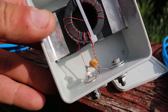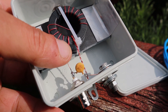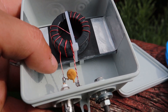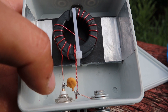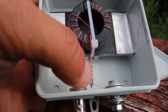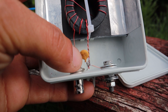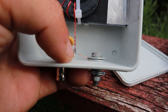The midpoint of the coil, after the two turns of the primary, goes to the center pin of the coaxial cable, and the very beginning of the primary goes to the ground. Between the ground and the center pin of the coaxial cable there is a 100 picofarads capacitor. Unfortunately I didn't have 100 picofarads so I ended up using 130 — I hope it will work, but it should. I used 150 in the past and it still worked fine.